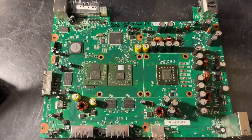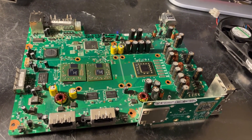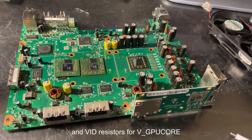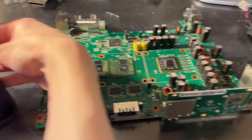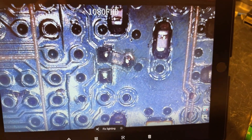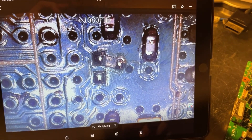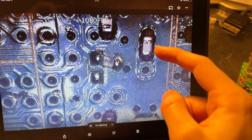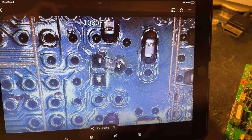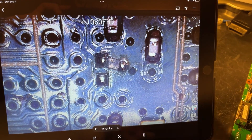You can see that this is a Xenon. Just like the Zephyr and Falcon, I removed a few resistors and changed the value of some other resistors for the PCIe and memory calibration. The FSB calibration was completed using the same resistor method where you remove this resistor and take another resistor and connect it to the upper pad tying to VGPU core. However, unlike on the Zephyr where I connected it to this conveniently located VGPU core on the top of this cap, I simply exposed here with my grinder pin where the VGPU core plane is and attached the resistor kind of diagonally, and that works perfectly.